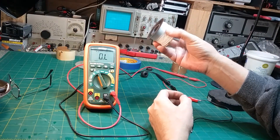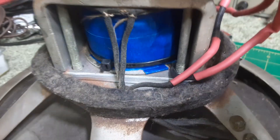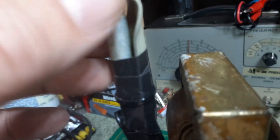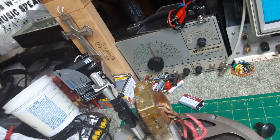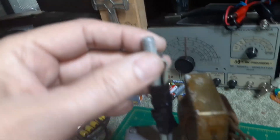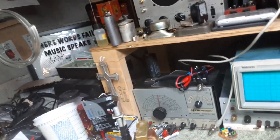Nice coil — that looks good. There it is with new wires coming up going to the output transformer. Put some tape here holding the adjuster, and a wire tie there to hold it. It's all set for the height of the speaker — the voice coil works great.